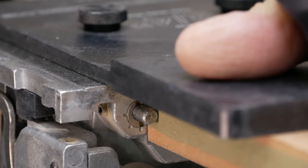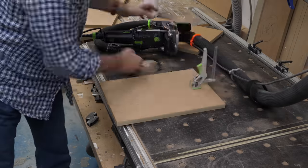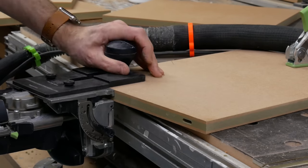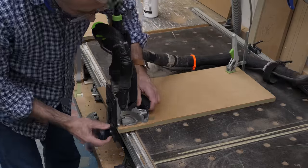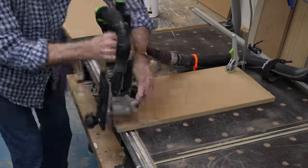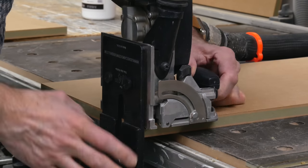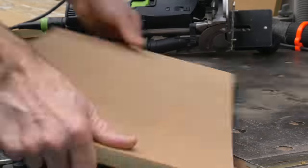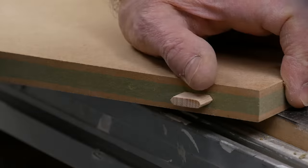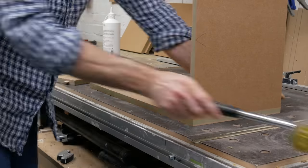There's no measuring or marking as I'm using the sprung pins to reference off the front and rear edges of the base and top, cutting narrow mortises to fit the 5x30mm Dominoes. The Domi plate comes into its own for making the face mortises in the carcass sides — no need for an L-shaped support here. I'm using a slightly wider setting for the mortise as this gives a bit more wiggle room in the glue-up. The narrow setting on the edge makes for a very snug fitting Domino, and the mid setting on the face makes for easy assembly.